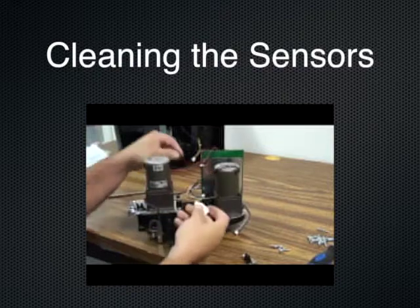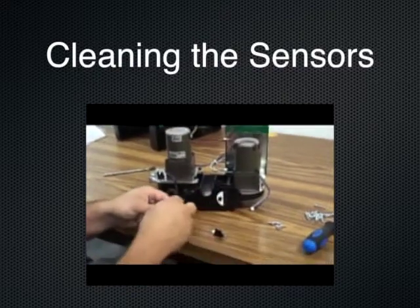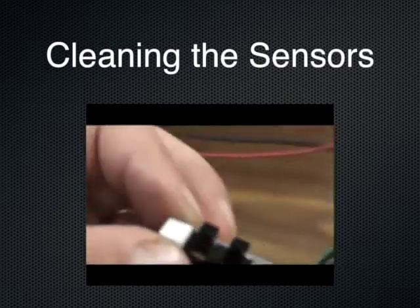And third and the final step, one that doesn't have to be taken as often but should probably be done on a monthly basis, is cleaning the sensors that are on your machine. There are two photo sensors on the interior of the machine that can over time fill with tobacco dust. Simply by blowing these out, you can keep your machine up and running with little trouble.